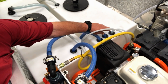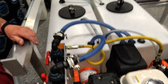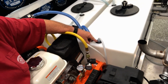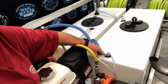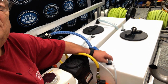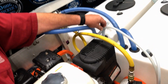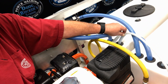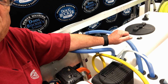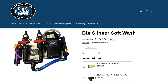Over here for the Flow Pro we have a half-inch Uniseal but quarter-inch hose. What we do is take a little piece of half-inch clear braid hose, about four or five inches, slip that through the half-inch Uniseal, and then run our quarter-inch hose into the bleach tank as well as the water tank. The quarter-inch hose just slides right through that little piece of half-inch hose. That's the main thing I want to talk about — the Uniseals.